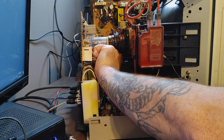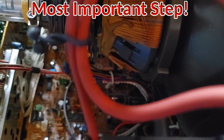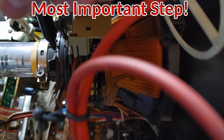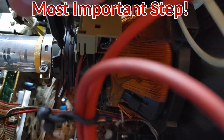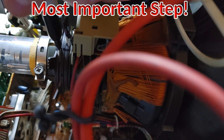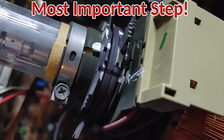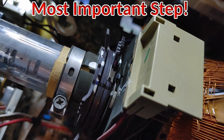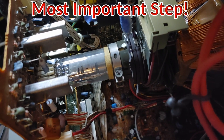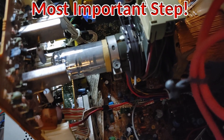The most important step before going to the rings: mark your rings. This is the most important step, and as long as you mark your rings first, you can always revert back to stock and keep yourself out of trouble. Mark a perpendicular line down all three pairs of rings and even get a little bit of marker on the plastic assembly — that way you have an index mark to get everything back to stock if needed. If you have any epoxy or silicone on a consumer tube, you'll have to separate it with a razor, but on these PVMs they're free as a bird.